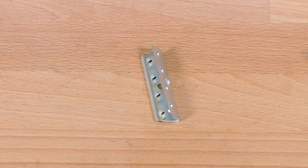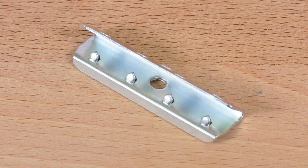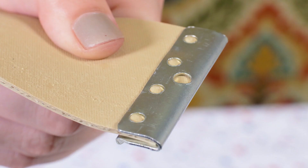You also need to know the anatomy of a clip before attaching them. The lipped end will go in between the webbing and the edge of the groove so the sharp wood edge doesn't wear away at the webbing over time. The teeth of the clip are also placed in such a way that they will dig into the rubber when it is sat on.